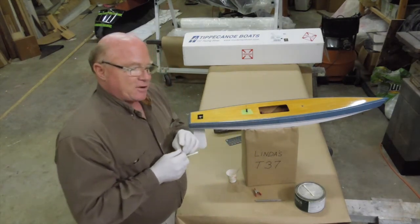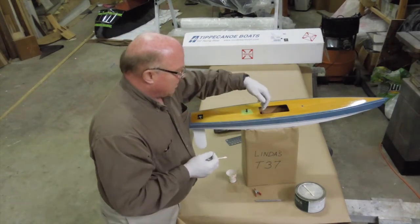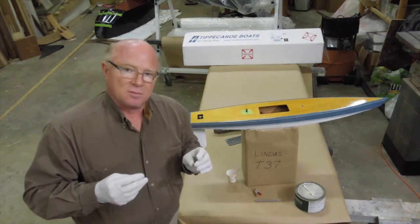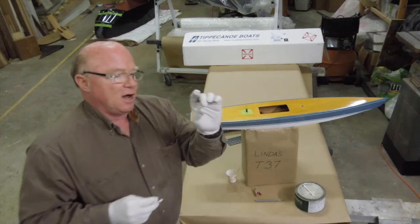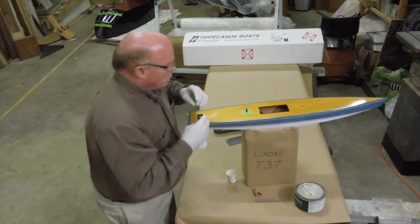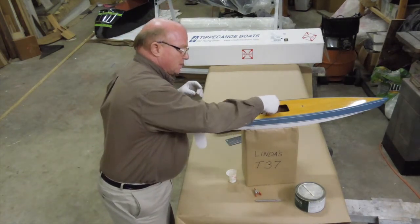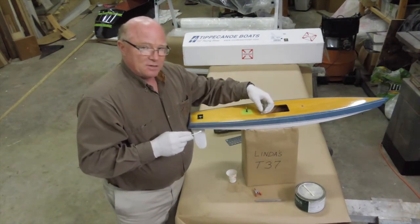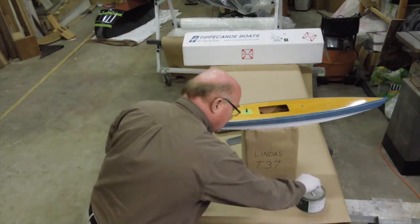Now, we have to anchor that. We have to screw an eye on the underside of the deck. And the deck is so thin, I'm concerned about having the eyelet screw through the deck. All this is a very simple little block of wood. We're going to glue it on the underside of the deck right about there. So it's going to go on the underside here. I've already sanded the underside and I've already cleaned it up, as with all of our structural bonds.